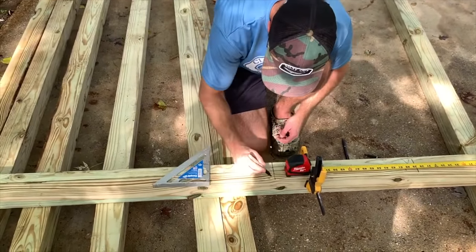And you're typically going to frame your window's rough opening a half an inch wider and taller than the actual window. So for a 14-inch by 21-inch window, I framed it to 14.5 inches wide by 21.5 inches tall, as shown. So after planning out your shed window's rough opening, you're going to start laying out the window components similar to what's shown in this figure.